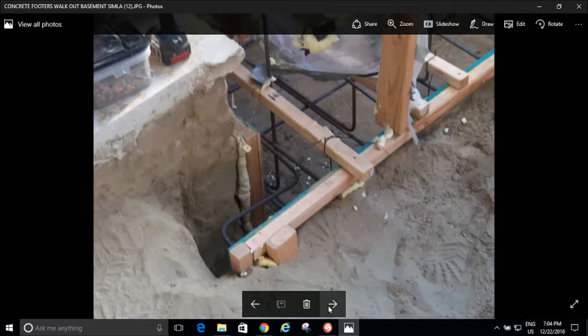And I got myself a little rebar bender. It was a good investment for this project because I was able to make all those 90s on my rebar bender. And the rebar is just so much stronger because if you just try to cut it right there and cut it right there and tie it with baling wire, it's never going to hold. And so that bender was the right tool for this project.